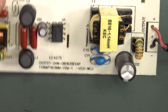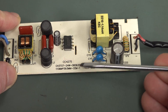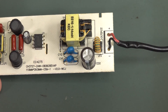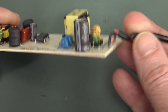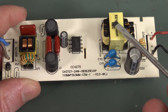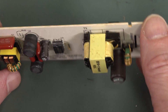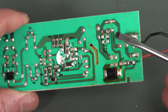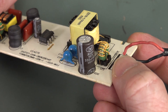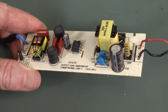The reason they do that is to lower cost - you don't need any secondary side regulator IC, you don't need any opto coupler. That's why you're almost certainly going to get flicker on the output. It depends on the type and size of your output cap as to how much you'll get. There's nothing inherently wrong with transformer feedback instead of opto coupler feedback, but the problem is there is no secondary side constant current regulation, and they've got a piss-weak amount of output filtering. That's why you get a metric crap-ton of ripple and hence flicker on this thing.